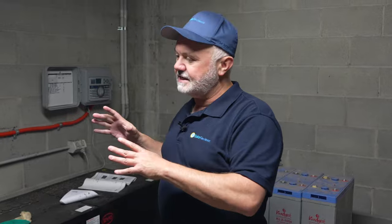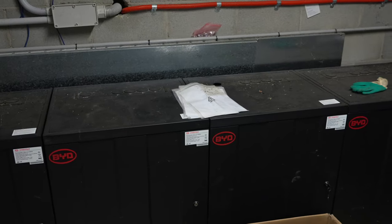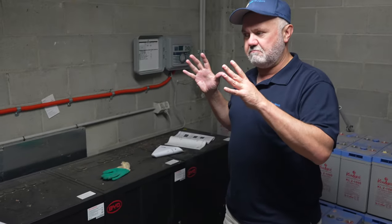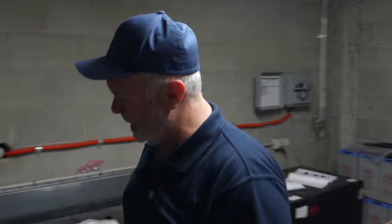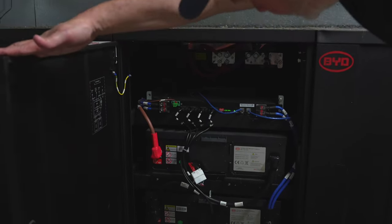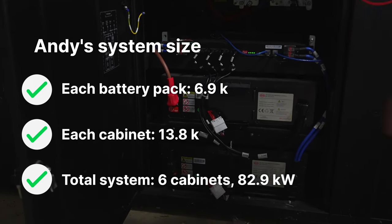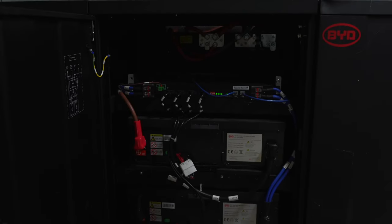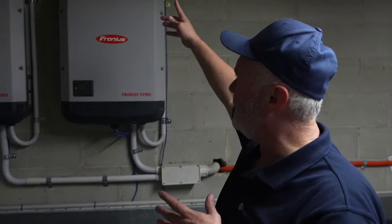Skipping forward to another generation — I went to BYD batteries. BYD is a Chinese lithium-ion battery manufacturer. You might think 'shock horror,' but BYD actually make most of the lithium batteries used in airplanes. Each one of these battery cabinets has about 12 kilowatts of battery storage in it. Inside there are a whole heap of little lithium-ion battery cells and a battery management system.